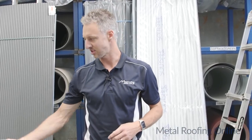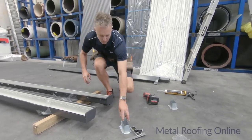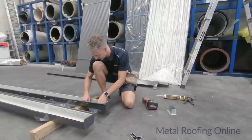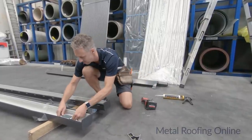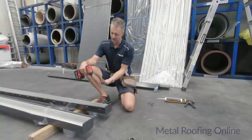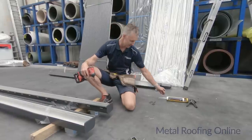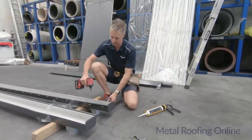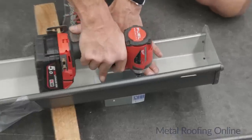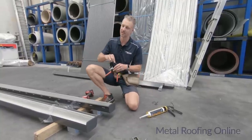I'll just put a couple of bits of timber under there so that when you're doing this it doesn't scratch the gutter on the concrete or whatever surface you're on — the gutter will look pretty bad when you put it up if it's all scratched. Now I'll drill out all the holes and then take the pop back out again and put the silicon in between the join. It's always best to put the silicon between the join — it seals a lot better. Then put a couple of rivets in to hold it temporarily.